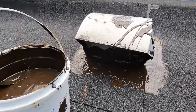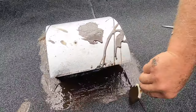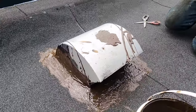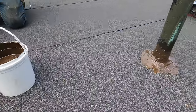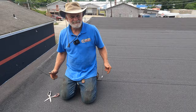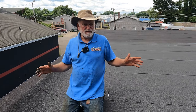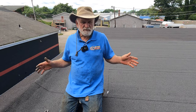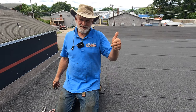I did the flashing around this thing and it looks nice. Flashing is done — around this and around the vent pipe — done, that's how you do it. Quickest, fastest, easiest roof to do: Turbo Poly Seal and the self-peel-and-stick membrane, and you're done. Thanks for watching, we'll see you in the next video.